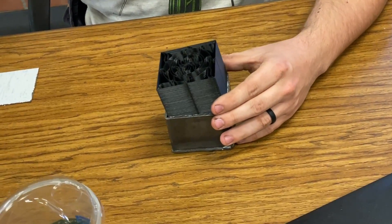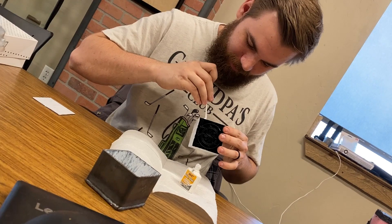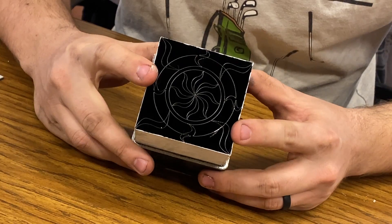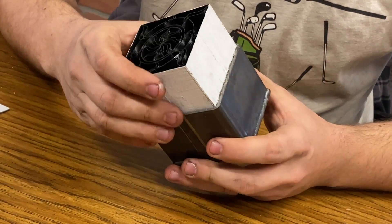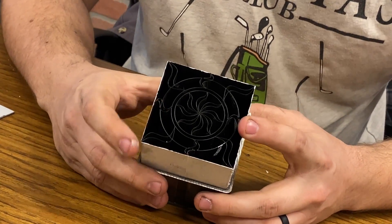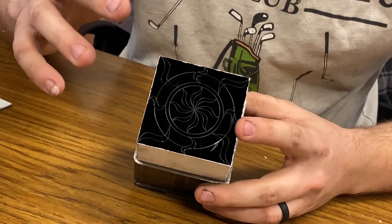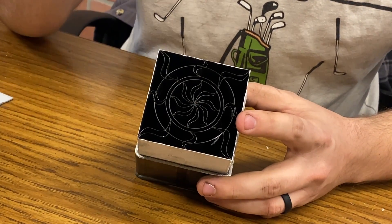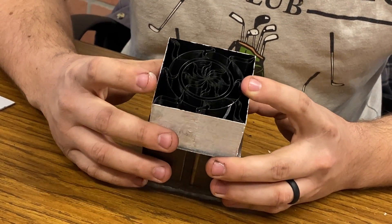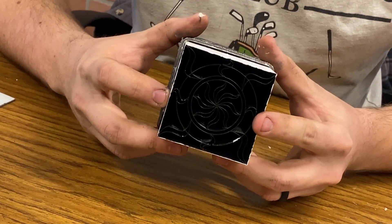For extra precaution, you could wipe out the sides of that thing — wipe out all around it. And then we fit it in there. Do you just squish it in first and then add the powder? Yep, I'm going to slide it into the can and then I'll add the powder, pack that down pretty dang tight. And then the idea is, because this PLA is mostly cornstarch, that carbon integrates itself into the steel and then the coloring of the PLA burns out. You'll see that when we put it in the forge, you kind of get a little bit of a firework show. That's that plastic burning out, and then I'll do some presses and it should all hold form.